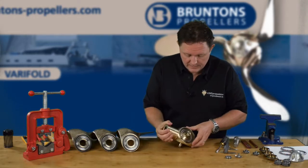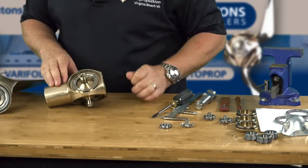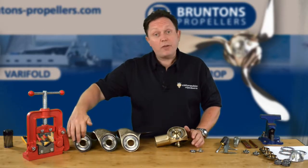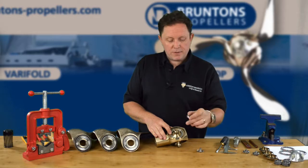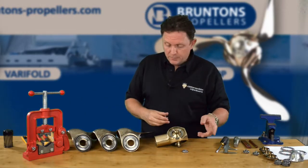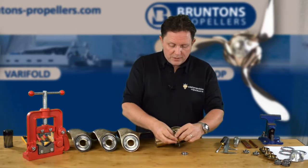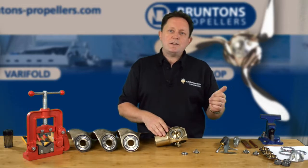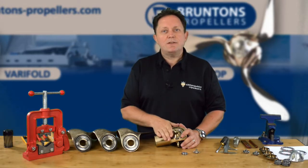Now on the bench I'm going to use a little pipe vise just to hold the hub, then we'll start reassembling the blades. In this video we reviewed putting the seals on, added the races for both the taper roller bearing and the thrust bearing, got the hub ready with its races, and now know which way up the nut goes on. We're about ready to assemble the blades, thinking about Loctite, torque values, and all that good stuff — we're into the final stretch. This is when it starts to look like a propeller again rather than three lumps of bronze. Thank you very much for watching. If you like this video there's a subscribe link in the bottom right-hand corner — click that for automatic updates when we add further videos.